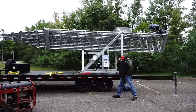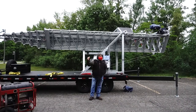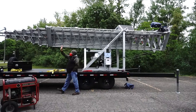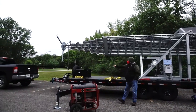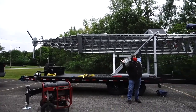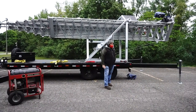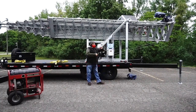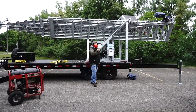Right now in my toolbox, I have 9 guide wires. For this tower it's 9 guide wires, okay? We put the guide wires at the top, in the middle, and in the bottom part, right? Right now the guide wires are nice and neat. When you remove the tower from the side, good luck trying to put them back. It's a mess. So that's why you have the reel. You move the reel, somebody holds it, you lock it there, and you store the guide wire there.